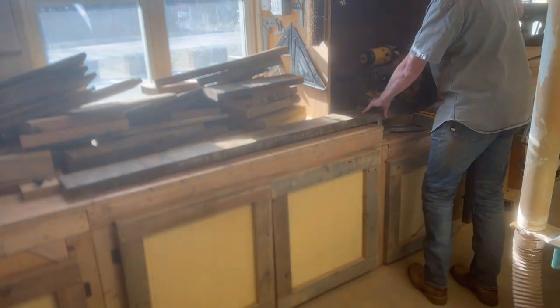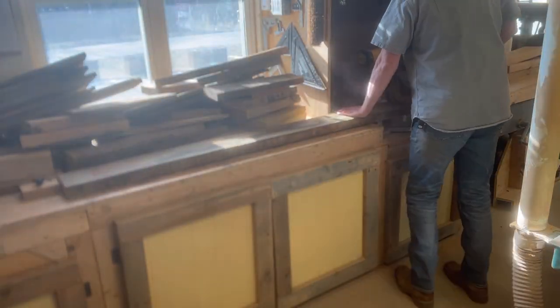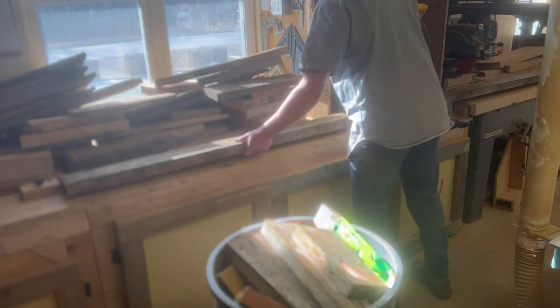It's a real simple cut list. We're gonna cut six boards to a little over six foot long and six boards a little over 34 inches long. And after we get them all planed and joined up and glued up into the panels, we'll cut them to final length. Right now I'm just cutting them about an inch and a half over.